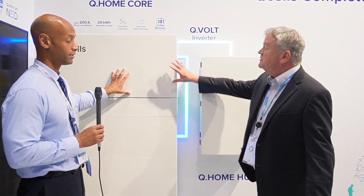So it's 7.6 kilowatts per inverter, and then you can have multiple inverters each with three or four batteries? Correct. Each inverter puts out about 32 amps of power. So if you were to stack four of these inverters together, you could actually supply your home with 130 amps of power.